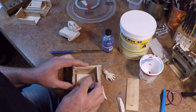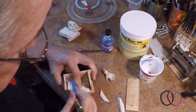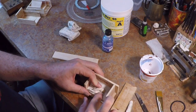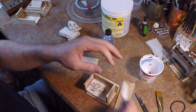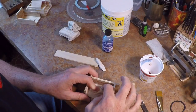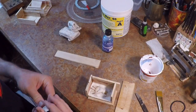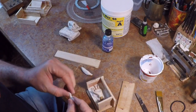I'll pick it up and stick it in the box and mush it down into the corners. I use this paintbrush here — it's got a nice round end that makes a good stylus for mushing the clay around in the mold. Now I'm going to build up a little dam of clay all around and determine where the parting line is. I take little pieces of clay and work it all around the edges and down between the fingers, deciding where the parting line is going to be. Spend time here — this determines the quality of casting you'll get.